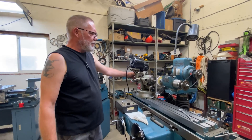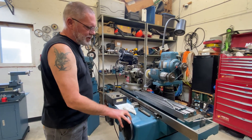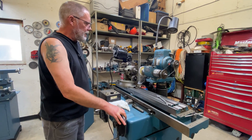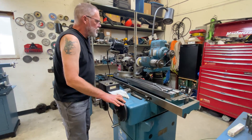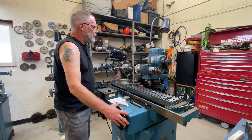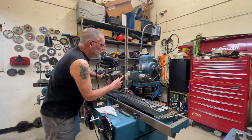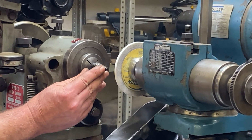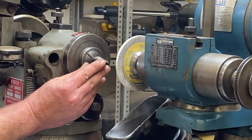Close to being set up here. The final thing before I touch off: this machine's table travel has a high and low range. This is the high range — it moves pretty abruptly. But when I pull this out to low range, you can see I get much, much smaller movements out of this table. So I'm going to touch off somewhere over here using my cross-feed handle, and then work my way in until I engage with this angled surface.